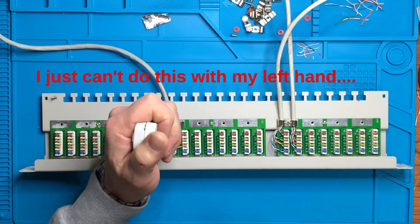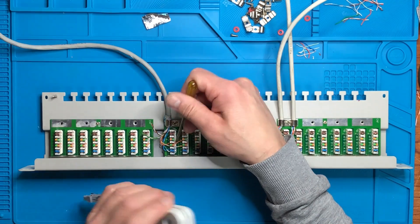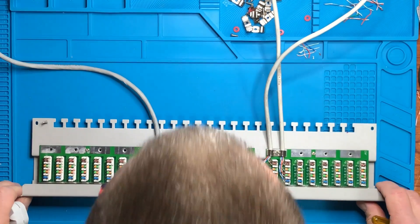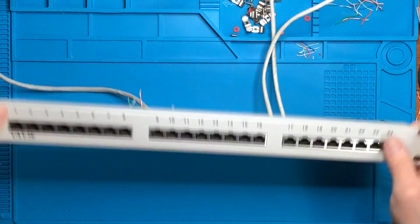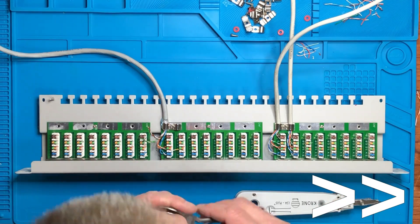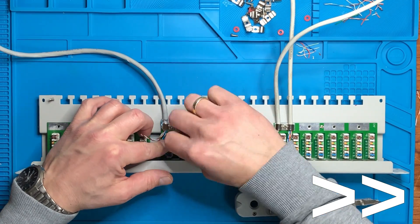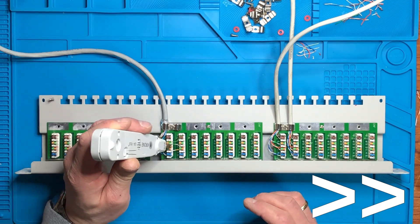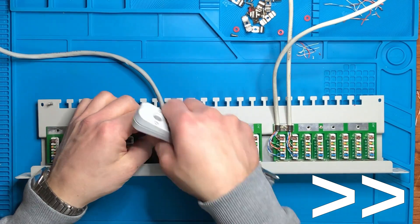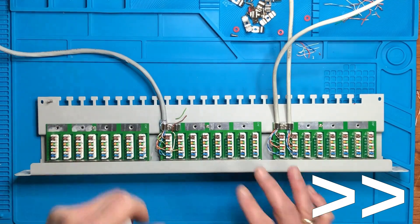You will end up with a lot of small pieces of cable in your patch panel, so remove them immediately because you don't know if they are loose inside. If you do many connections you might lose track of whether there are still pieces of wire in there, and that might short circuit things. Always remove them immediately and keep the inside of the patch panel really nice and clean. Once you get used to this — after your 10th or 20th installation — you can do this really fast. It takes a bit of practice in the beginning, but don't worry.